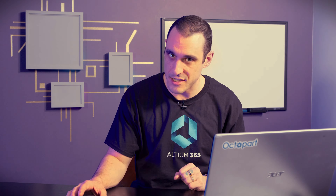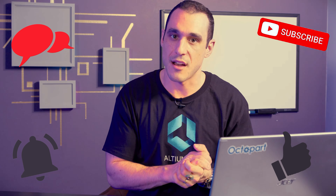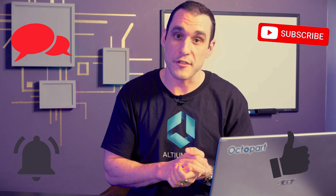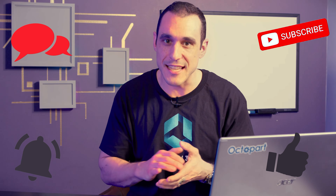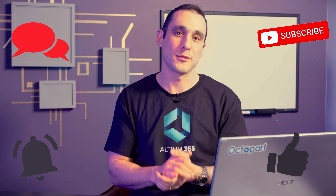This is one of the most basic strategies to ensure your PCB has clean traces routed in two different directions, keeping everything well organized and easy to trace between components. If you have the opportunity to customize a pinout on any of your components, keep orthogonal routing in mind — it will help you keep everything organized and looking professional. Thanks everybody for watching. Leave your comments and questions below, let us know if you try to always implement orthogonal routing, hit subscribe to keep up with all our tutorials, and don't forget to call your fabricator.